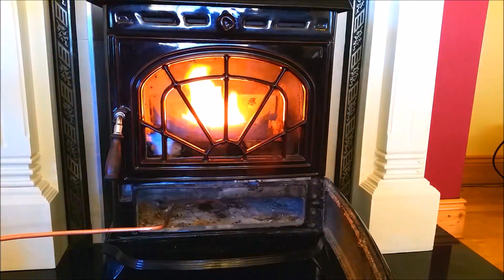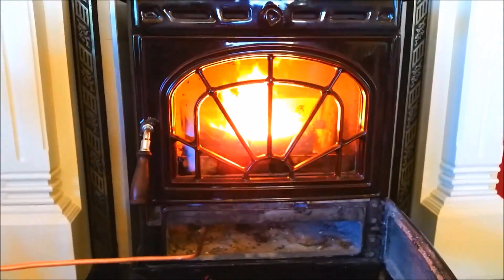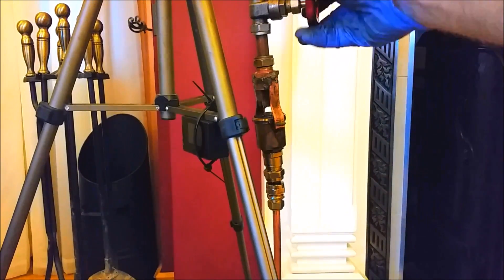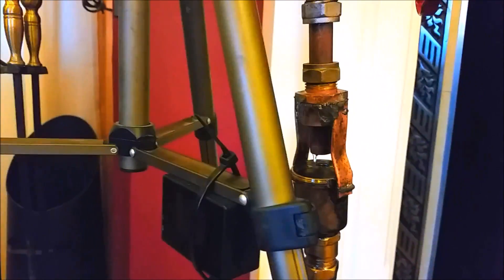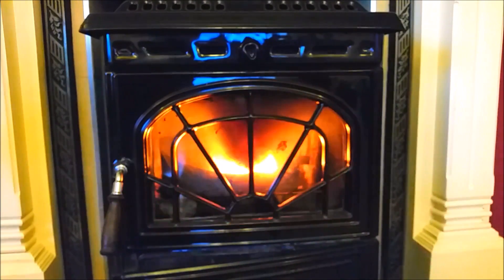I'm going to close this and give it some oil. Here goes the oil. That's the temperature of my water in the jacket of the stove - it's 20 degrees. As the stove continues to burn, obviously that temperature is going to rise. The valve, which is fairly not great, has gone to drips now. I need a stream a little like that - one up from a drip - and I can actually maintain a good flame. I need to direct the flame away from the glass; it is getting a bit blackened, but the flame is very bright in behind that.